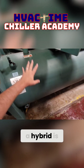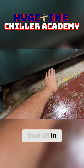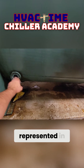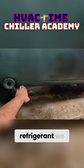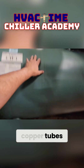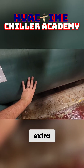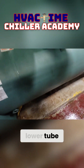The hybrid combines the two. There's a series of pipes that sit in constant liquid refrigerant in the bottom — several inches of it — and you can see it represented in the sight glass as a true line showing how much liquid refrigerant is held. Up top, regular copper tubes have refrigerant rained down through a rail system, and the extra refrigerant that doesn't boil off collects in the bottom, keeping the lower tube assembly covered.